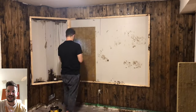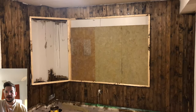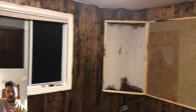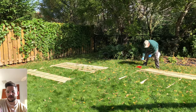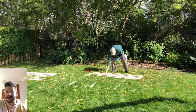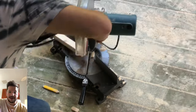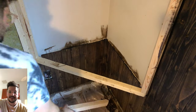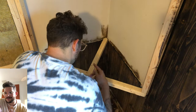This is the control room insulation, upholstery, and trim. We are using the same Rockwool Comfort Board 80, the rigid acoustic insulation. I'm using just some drywall screws — not structural — just so the insulation won't fall out as we're installing and won't poke into the fabric once we upholster it. A couple of drywall screws just to hold the insulation in place. We wouldn't have needed to do this if the frame was four feet tall, since we could have press-fit the insulation inside, but since we are taller than four feet I'm using those drywall screws. I have a video on my channel dedicated to these bass trap and acoustic wall combos if you want to watch just that portion.